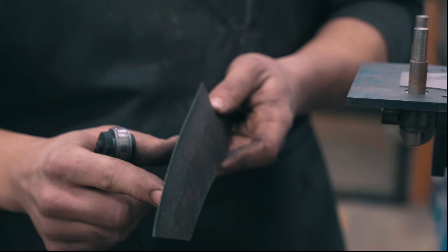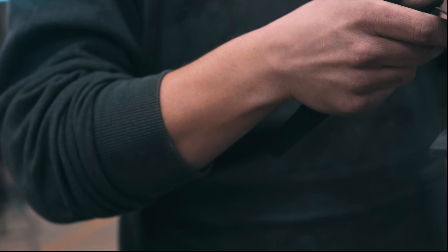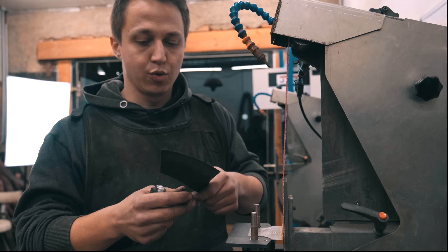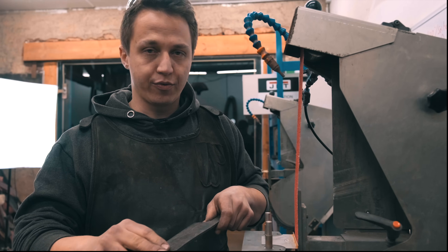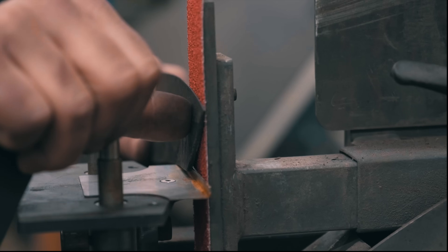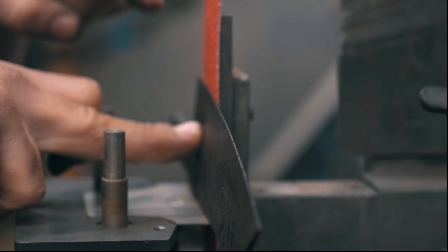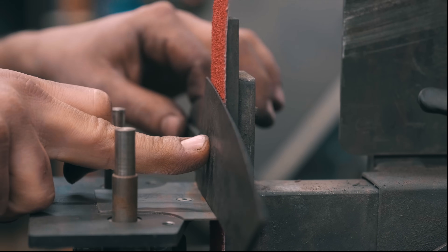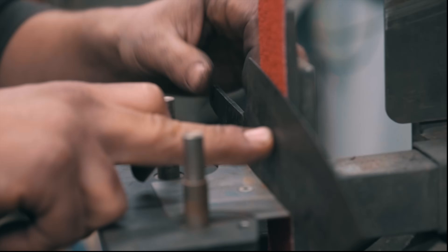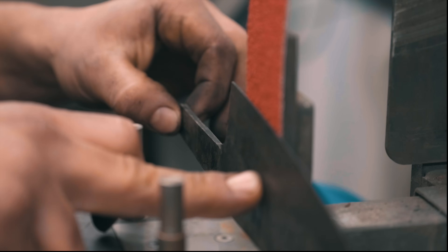The beauty of this is that my reference surface is actually the spine of the knife, so I don't need any other clamping points or perfect reference surfaces — only the spine. If I push it here, the angle is basically given. As long as my pressure point is in the middle of the height of the blade and in the middle of the belt, my knife is geometrically defined. This hand only does the axial movement — going back and forth. You don't want to change the angle with this hand, so I'm rather loose on this side.